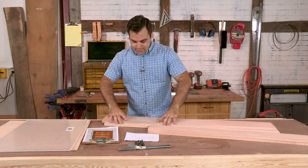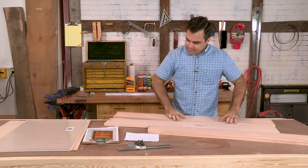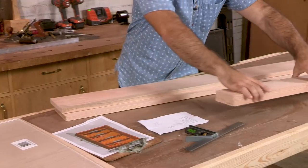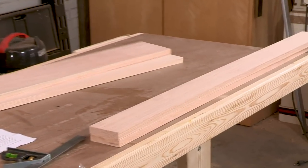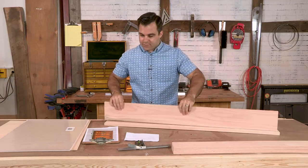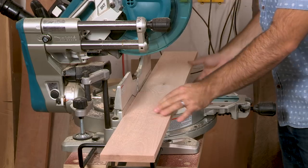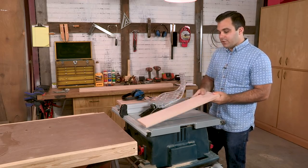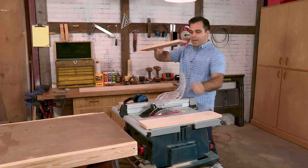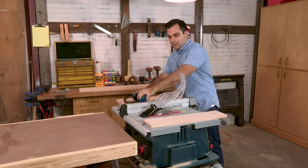I'm going to start making the pieces out of the one by six and the one by four. I need one side, a shorter top, one side, and a shorter bottom out of the one by six pieces. The one by four stock will be for the shelves. These are going to have rabbets three eighths in on the ends for the top and bottom. Now that we've crosscut from the miter saw, we rip the sides down to five inches — they're six right now — and the shorter top and bottom pieces come down to four and three quarters wide.